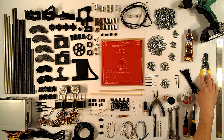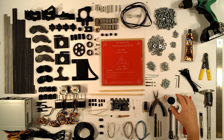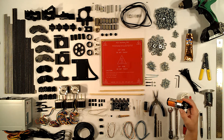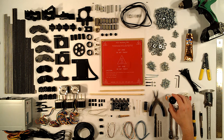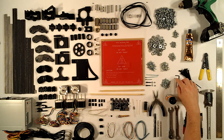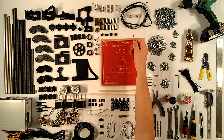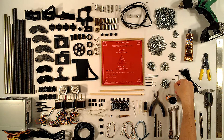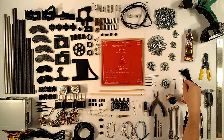You'll need wire strippers or wire cutters, about a dozen zip ties, and some oil — I'll be using gun oil, but any low viscosity oil should work fine for the smooth rods and Z-screw. You'll need a set of allen keys: a 1.25mm allen key for the set screw on the aluminum pulleys, and a 3mm allen key for the M4 bolts.